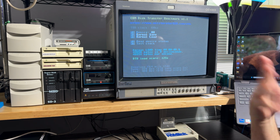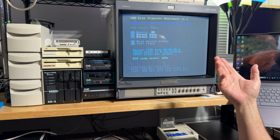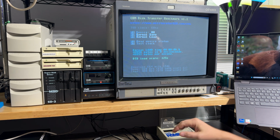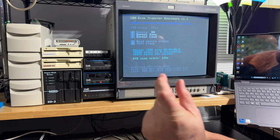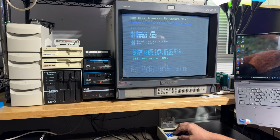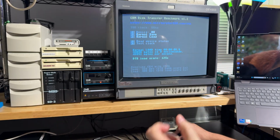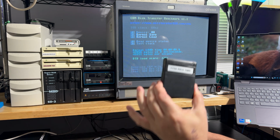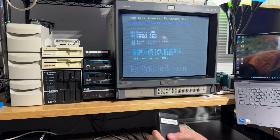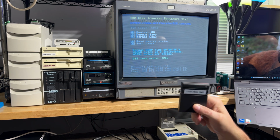And so that's my question, right? And again, I am guessing here. I'm no electronic engineer, but the internal card here has no REC chip. It doesn't have that square chip, and in the 1700s it was actually a DIP chip, but a longer, skinnier chip. But in the 1764 and the 1750, and in the clones, in this particular clone at least, it uses the square chip, the same as the 1764